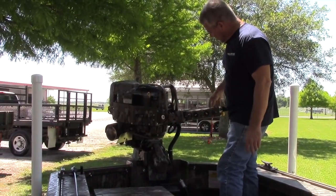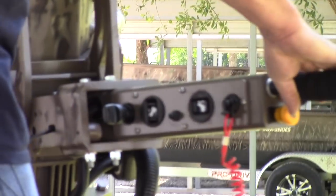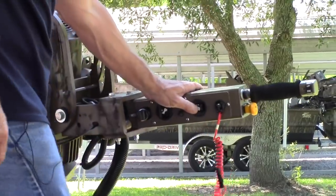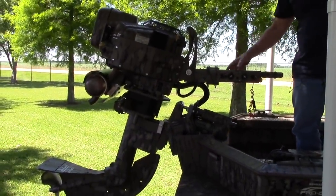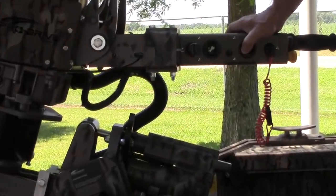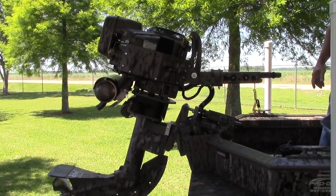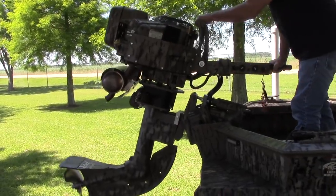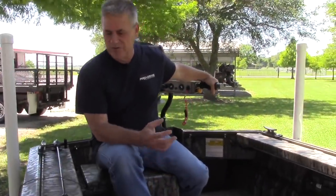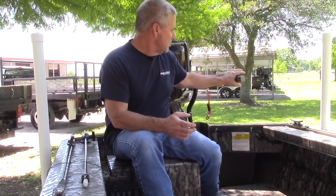If you look here, there's a reverse switch and a trim switch. We had one trim switch here, but let's say you're working in a lot of vegetation or water hyacinths — you're working the motor like this. You don't want to reach back to grab your trim; you work your trim right here. And your reverse is right here. I'll trim this motor up a little higher than it really needs to be because it's due to the trailer. Your trim switch is right here, and you can work your trim back and forth — it takes about three and a half to four seconds one way. The ProDrive motor with the shorter foot and the shorter handle is a real easy motor to steer and turn.